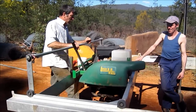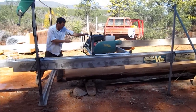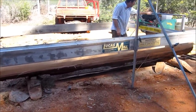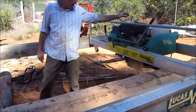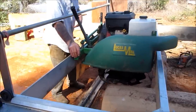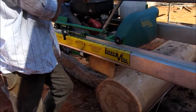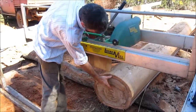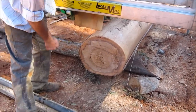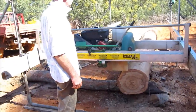So what we're doing is going along — we put some water in the machine, we're lining it up to the log. We're going to cut along the grain, not across the grain, to get the best out of our log. Then the other thing is to get your vertical height the same — take a measurement from here to the centre of the log, go to the other end, measure the centre of the log, so when you're coming through you come parallel with your centre. Basically your box out around your heart is the term they use. Anyway, we'll fire her up and start milling.